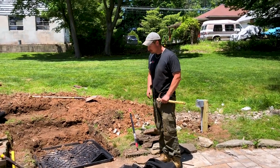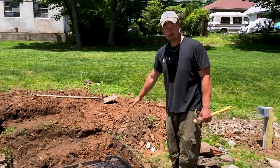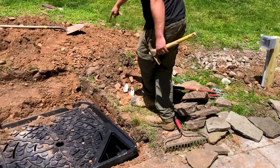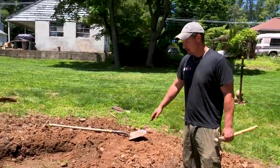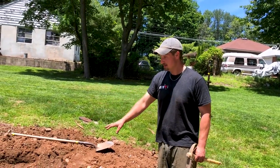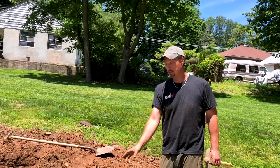We're making good progress here. As you can see, we've got our aqua basin laid in — it's level side to side, front to back. Our next step is carving a trench to get our piping up and around the edge and up to our spillway. We've also started to excavate our ledges where we're going to create our waterfall. On those ledges you're going to get two different drops. We'll add some lights in, so as the water is cascading down these falls and into the bottom, it'll be illuminated at nighttime. It's going to be really cool.